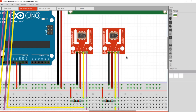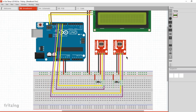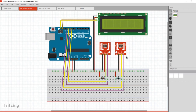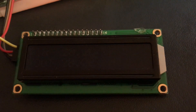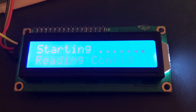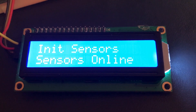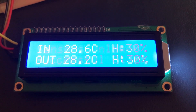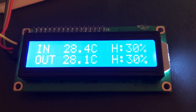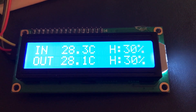Without those pull-up resistors you'll get readings like minus 40 degrees Celsius and ridiculous humidity figures. So put those in and everything should be good. Just thought I'd quickly mention the intro showing what is actually a fake bootloader — a bit of folly on my part. I thought it was funny and it looked pretty cool. I'll show you the code for that when we get to it, but you don't need it. It boots straight into the main display within about 2 seconds.